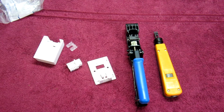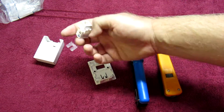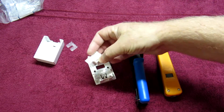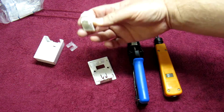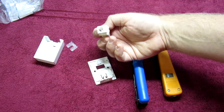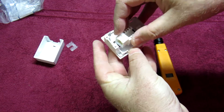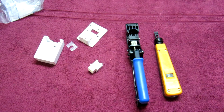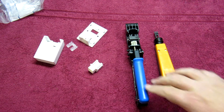Hello YouTube. I've shown you guys how to do the RJ45 plugs and now we're looking at the sockets. I like to use these keystone type jacks for simplicity reasons — they work pretty well. These can be used in normal sockets, wall sockets, or on surface mount boxes by simply clipping them on and then popping the cover on when you're done. Today we're going to show you guys two ways to terminate these keystone jacks.